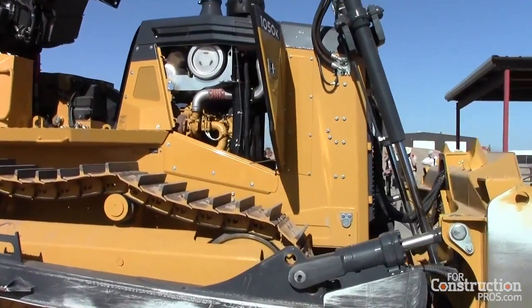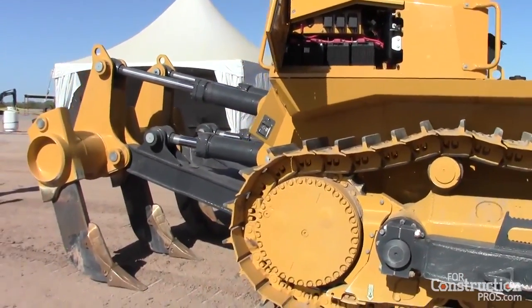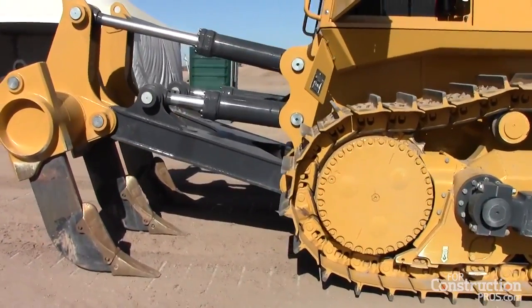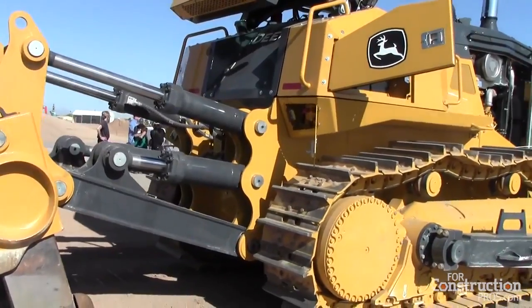We fully expect customers to say that eco mode on the John Deere dozer is a great feature and run it all the time. We also recognize that some operators, if given the choice between eco mode and power mode, have historically chosen power mode. But if the owner understands he's not losing productivity and can save fuel, we can go into what we call owner mode and actually lock eco mode fully engaged so the operator can't turn it on and off. That gives the owner who loves the feature the ability to lock it in so his entire fleet can run with it on.